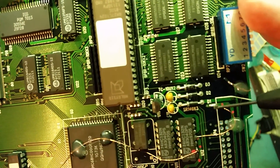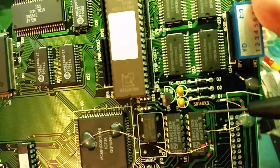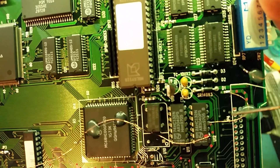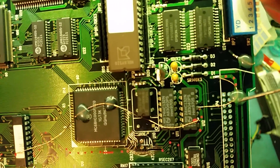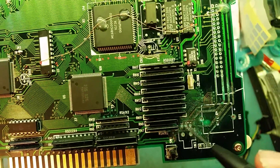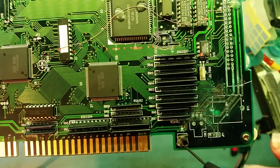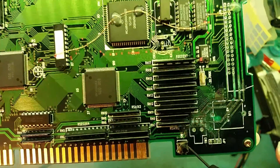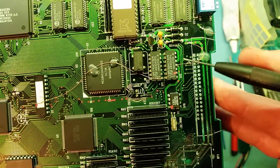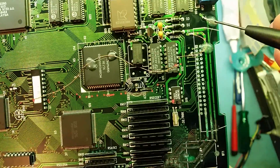You short from the track where the screwdriver is pointing, all the way to that pin — pin one, two, three, four — down to the fourth pin. That's the second mod, repairing the damage from where the switch is and where the tracks have been eaten away. You can remove the switch because it's usually covered in corrosion, and the reset switch usually is as well. I've taken it out and replaced it.